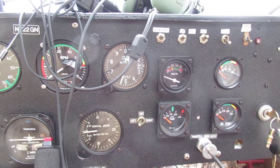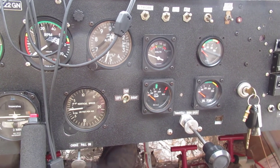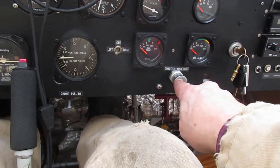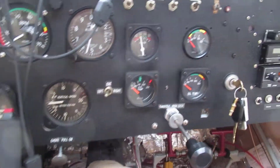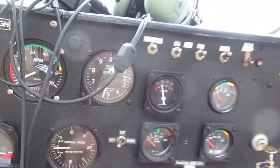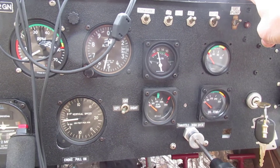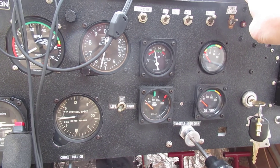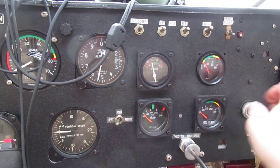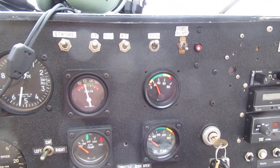At this point it should be ready to warm up. I gave everything a once-over. I noted that I didn't safety-wire the exhaust muffler springs on the muffler connections — I can do that later, but everything else looked okay. Fuel's on, choke is on, throttles closed — master mags. Let's watch the oil pressure. Let me give it a few seconds of fuel pump to get fuel into the carb. And I got oil pressure there — I'm going to stop filming so I can use both hands.